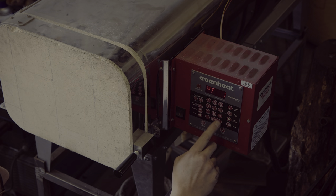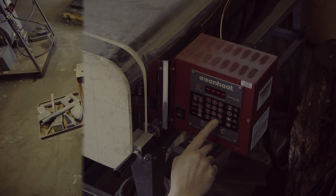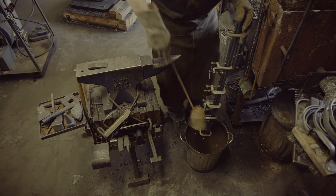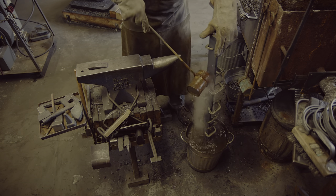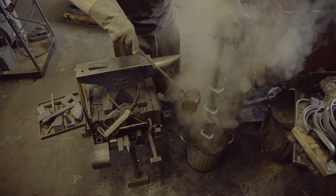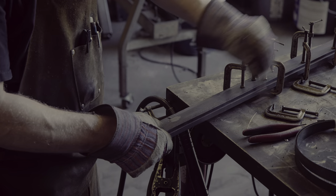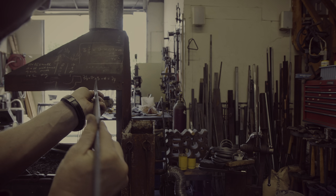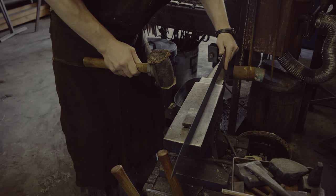My final temper will be at 550°F — much higher than I would temper knives at, but this seems reasonable for a sword that needs to withstand a bunch of abuse. I usually temper for about an hour and then remove the blade. Because of the heavy steel bar, this requires some heavy gloves. In this case, the gloves were not quite thick enough, so I am rushing to my bucket of water. Once I remove the clamps, I should be looking at a blade that is magically completely straight. It does indeed look much better, though not perfect, and I will try to remove some of the remaining bend over the anvil.